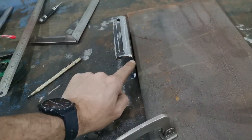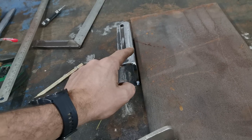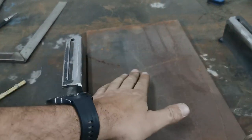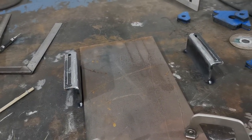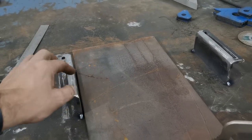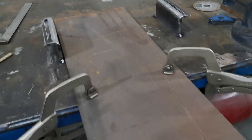The reason I've got these are only 50 mil high, but the plate on the bottom will be 80 mil, is because with the Simagic wheel, the rim is bigger than the Logitech, so the whole unit needs to sit lower in the rig so that I keep the same driving position. Of course, it will be adjustable, but I also want a bit more extra adjustability there. So I've allowed myself 80 mil to work with. Hopefully that works, and if not, we'll have to make another one.